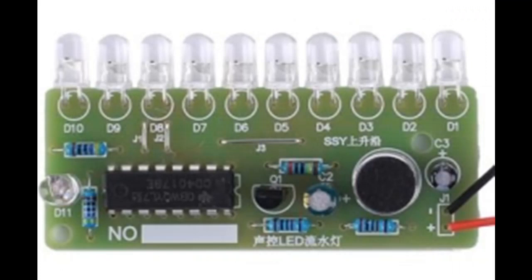And this is what the board looks like, fully assembled. And what this board turns out to be really is a light show. It's got a little speaker there, a single transistor amplifier, and with the resistors, it flashes the LEDs depending on the volume and the tone of the music. It looks nice when it's playing, but it works just as well without. There's actually nothing sound wise on the board whatsoever. It's just part of the light show. That's the part that I thought was disappointing. For some reason, I thought that was an audio amplifier when I bought it.